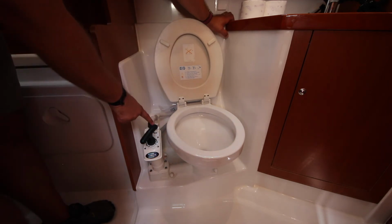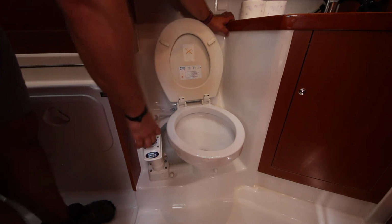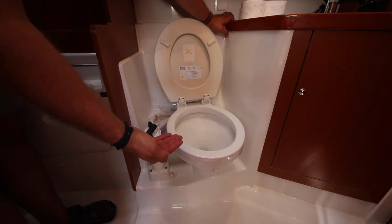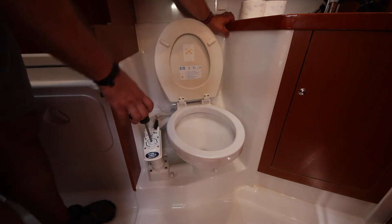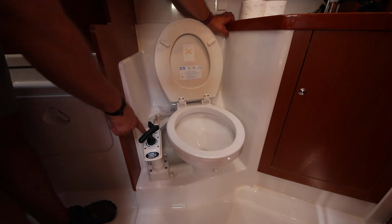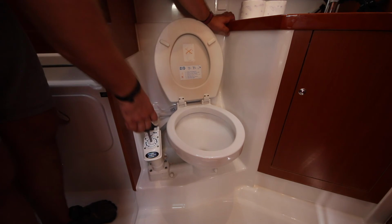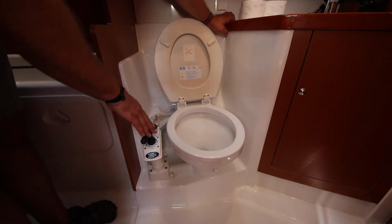When the pump is set to flush, bringing in water and letting out water, and you pump, the bowl will automatically rise to a certain level with water. To dry that water out, flick it over to pump out and pump all of the water out. When going to the toilet, flick to pump in, pump some water through so that you know the line is clear.